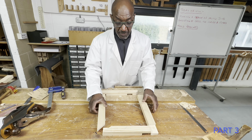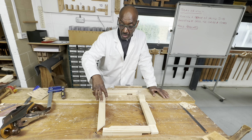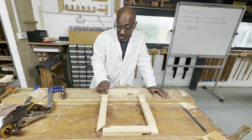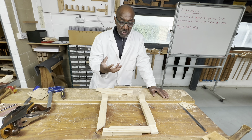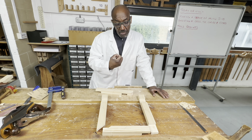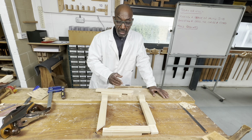We've completed all the cutouts for the cross halving, corner, T halving, mitred halving, the special detail of the horns, the chamfers — one there and one here — using my special aid, the bench hook. Now I'm going to show you how to square the frame, secure the joint using screws at the back of the job, and tidy up the surface end grain.